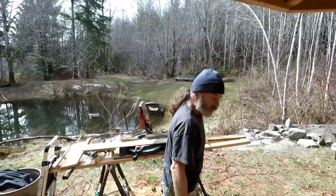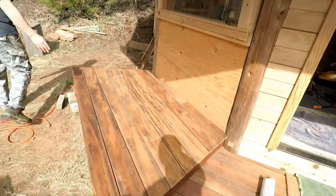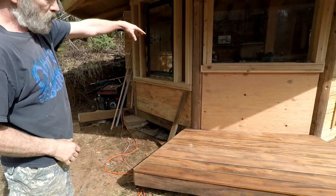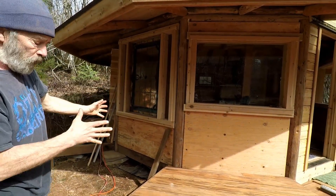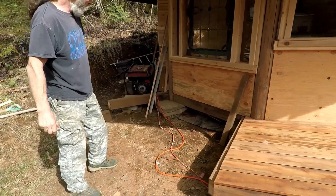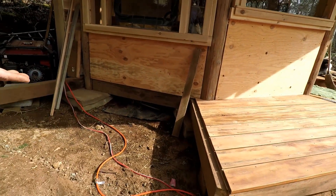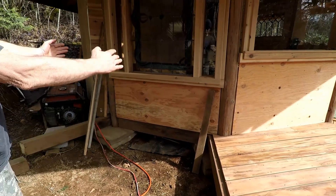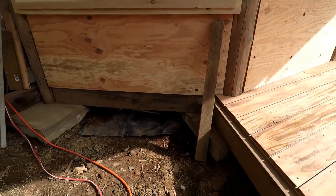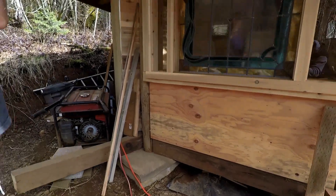So we did the main structure first, and then I put the floor in with these beams. I poured another two-foot square concrete footing in the middle of the structure, and the 4x6 beams go all the way in and out. The deck is kind of freestanding, which is nice — you don't need a lot of support. These are 4x6's going in between the poles, and then I framed in the rest with 2x6. Basically a really simple structure.